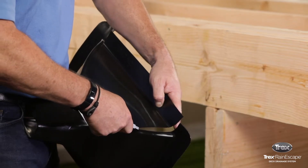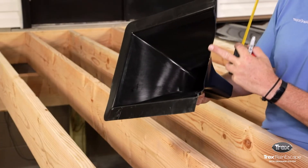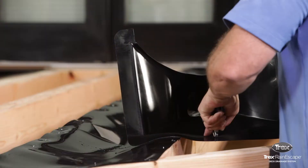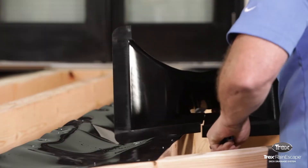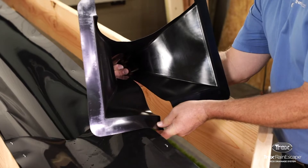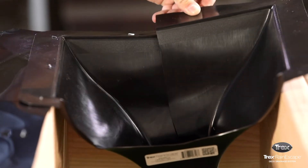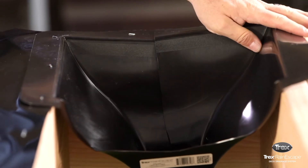After determining the correct side of the downspout, use your utility knife to cut out the front of the funnel on the 4-inch score mark. Cut the back side of the funnel from the inside nozzle out to the 1.5-inch flange. This second cut allows the funnel to overlap itself and fit snugly into the smaller bay opening.